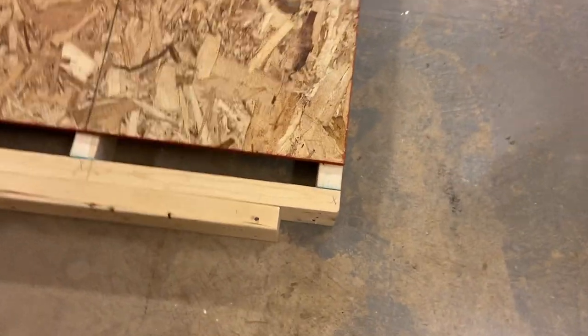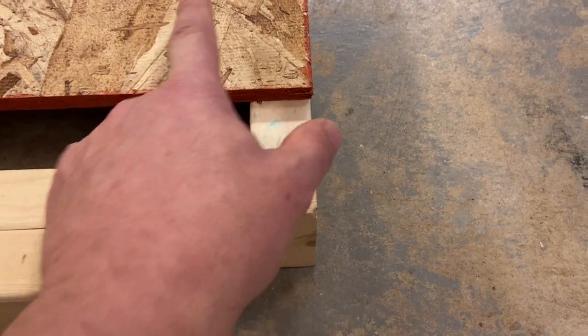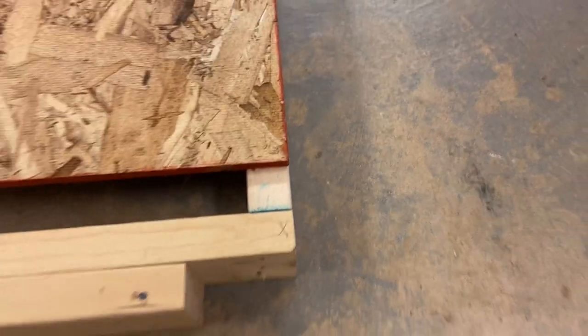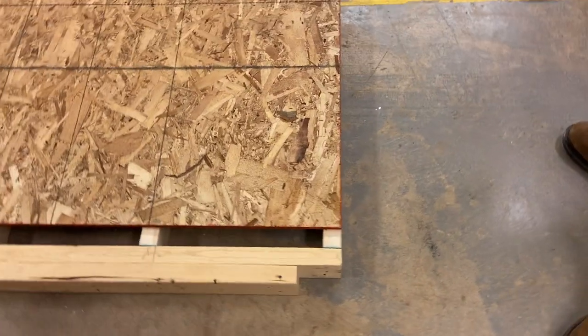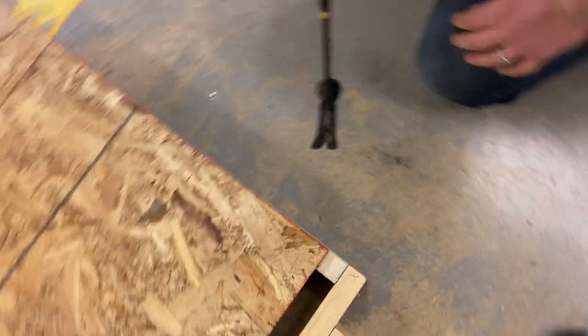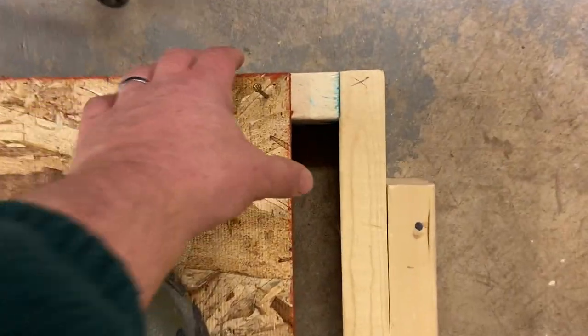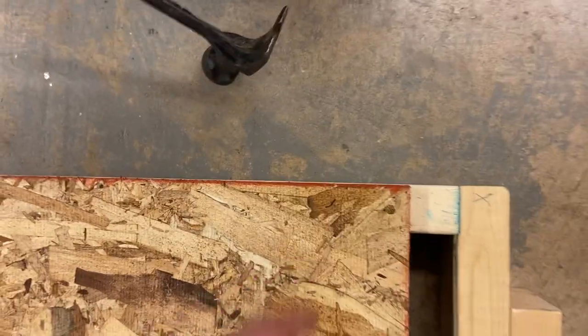Now we get to look all the way up the edge of this stud. I have a nice even reveal. It breaks right in the middle of the stud here, up into our window opening, and I look up here — I'm breaking right in the middle of the stud. What I care about now is my perfectly square sheet of plywood running all the way up and being flush with my top plate up here. It looks like it's hanging out just a little tiny bit. So all Shane's got to do is probably start your nails, Shane, just get it started. I'll take my foot and kick that back. This looks pretty darn close. Right here it would come up and plane right through the edge of my wall plate. That looks square. If I double check it over here, it's still in the middle of the stud. Shane, nail it off.